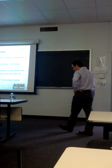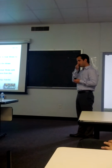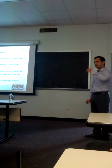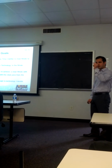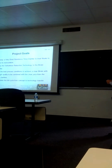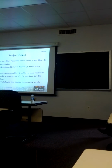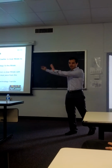Therefore, knowing that this technology was available, we wanted to revisit filtrate clarification with a whole new approach. So the goals of our project were, we wanted to develop a very short retention time filtrate clarifier to treat this filtrate and avoid its recirculation. We wanted to apply the turbulence reduction technology to the filtrate clarifiers. And we also wanted to find the best process conditions to achieve a clear filtrate with enough quality to be combined with the clear juice that is obtained in the main clarifiers. Finally, if we were successful, we wanted to complete the full cycle from the concept and implementation to the technology transfer.